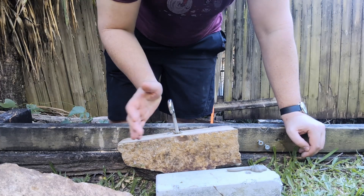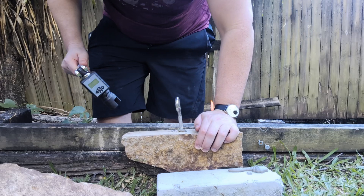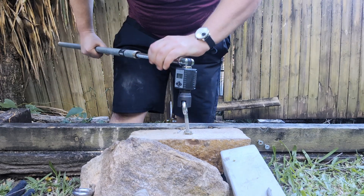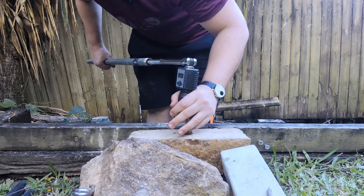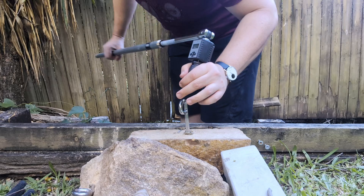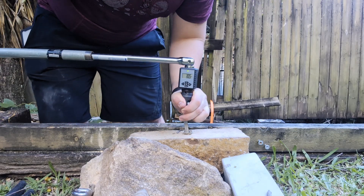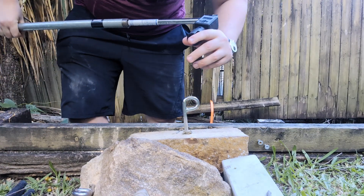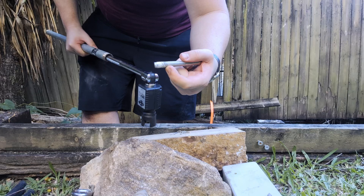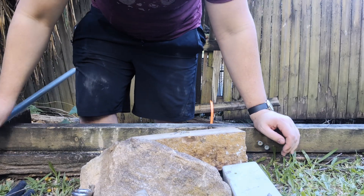It's been about 40 minutes and apparently it's 29 degrees today, so it should be good and hard. Let's try this one first and see what we can actually get out of it. Okay, 60 — it's starting to return and that was 59. So that was only in there that much and it got 60. I think a fully embedded bolt could easily get 150, as long as the steel doesn't break.